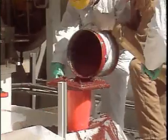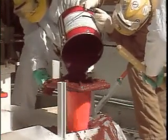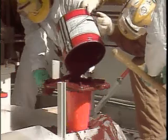As the Chockfast Red is poured into the base plate and up into each compartment, the air in that compartment will be forced out through the vent holes. Pouring is complete when Chockfast Red is coming out of each vent hole and the compartment fill hole.